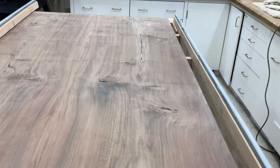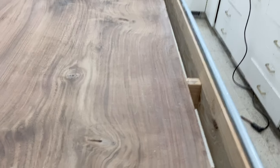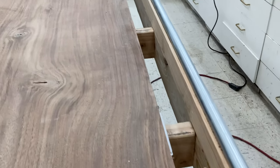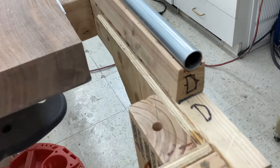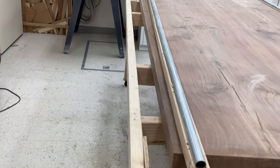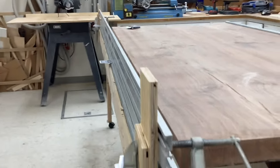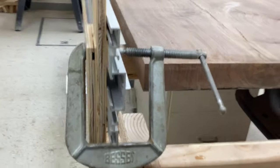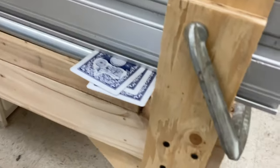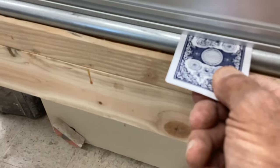The eight-foot long rails that carry the sled were made from one-inch metal electrical conduit screwed to a two-by-two. A dado was cut to hold the conduit in position. Recess screws from the bottom up into the conduit held it securely in place without distorting its top. The rails were connected to the table frame using diagonal screws starting at the side of the conduit, going through the two-by-two, and into the table two-by-four. An eight-foot long metal saw fence was used to test and adjust each rail so that its top was flat. Clamps and wood scraps were used to hold the fence edge vertical while resting on the rail top.